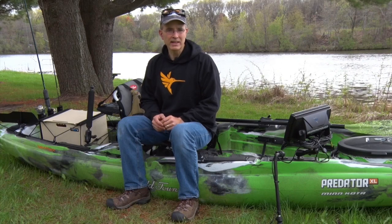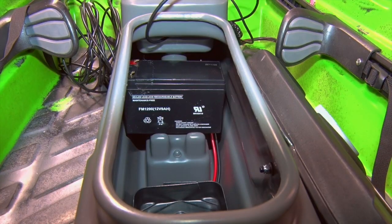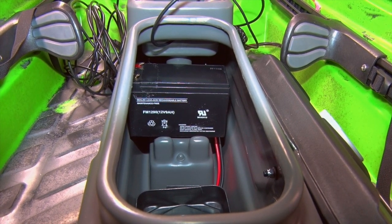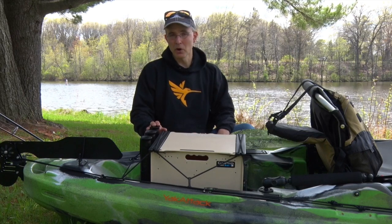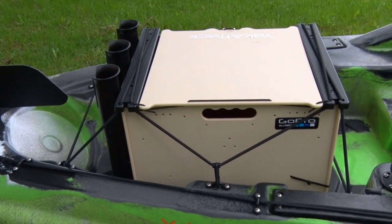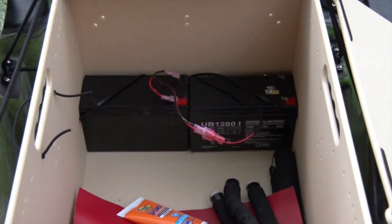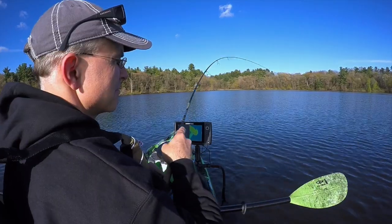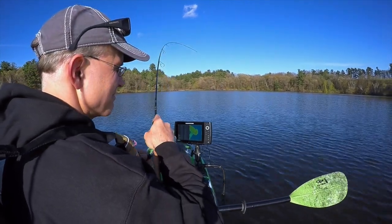We can deliver power to the Helix 10 in a number of different ways. Because I wanted the flexibility to use the Helix 10 either with or without the Minn Kota console in place, I decided to install a new 12-volt power supply independent of the one previously installed in that Minn Kota console. To provide power to the Helix 10, I decided to install not one but two small sealed lead-acid batteries into an external storage compartment — like this one from Yak Attack — that I added to the back of the boat. This pair of batteries fits perfectly end-to-end in the compartment and is secured with simple zip ties. I installed two batteries to accommodate the significant power demands of a large screen fish finder like the Helix 10.